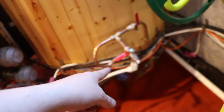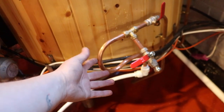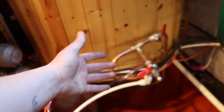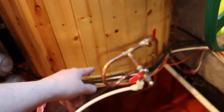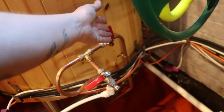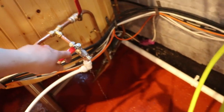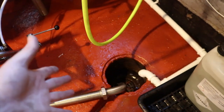On the output side we've taken a pipe and looped it up to the input of the HLT. I've saved some of the bent pipe that I made a mess of the other week while experimenting with the sparge arm on the pilot kit — that copper has got a new life in this little manifold. Within this manifold, you open that valve and you fill the HLT with hot water from the plate chiller. Once the HLT is full, if you've got overspill, you can open the other valve and connect a hose pipe to collect the water in buckets for cleaning, or let it go down the drain.